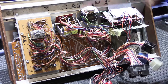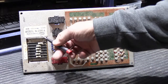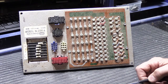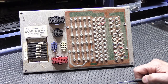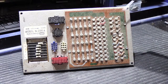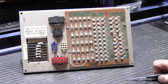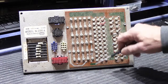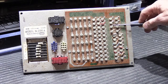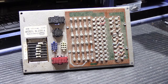This is the terminal board that goes behind the 2510. The front panel you just saw is the N2510B unit and this back section is the N2510A. What you have here are rows and rows of screw terminals — this is where the wiring for the remote speakers are connected. A 2500 system is an eight-wire system so there are many screws for all the eight-conductor cables.